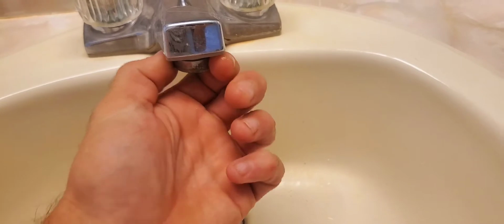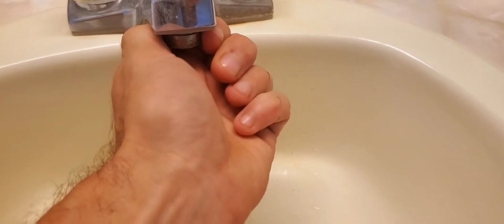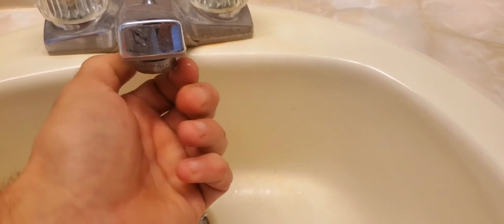Now, pressure is pressure, whether you're getting 1 gallon per minute or 5. The difference is, what everybody misunderstands, is you're actually looking for more volume. You want more water, not more pressure. You want more water. So now, that works great.